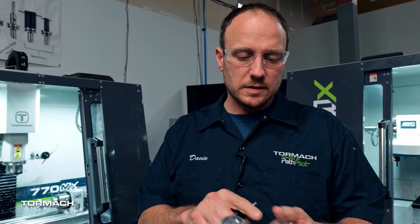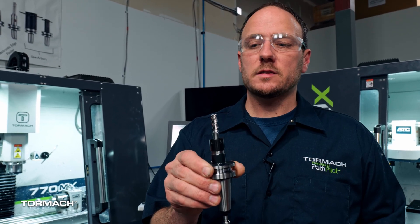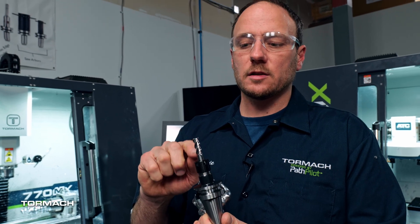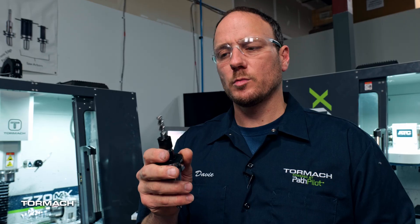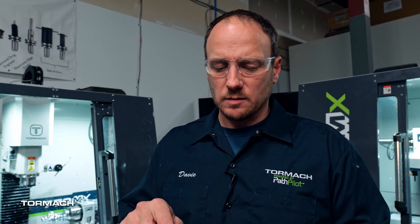For this last little bit, I'm going to switch to an ER-16M tool holder. It has a skinnier shaft on it, and I've got the tool pulled out longer than is advised, but I'm just going to be removing a little bit of material on the end of this job just to clean up space for the next tool, which will be a flat 1/8 inch end mill. It'll come in and clean some corner pockets and get extra material out of the way so that the ball end mill has constant surface engagement the whole way through.